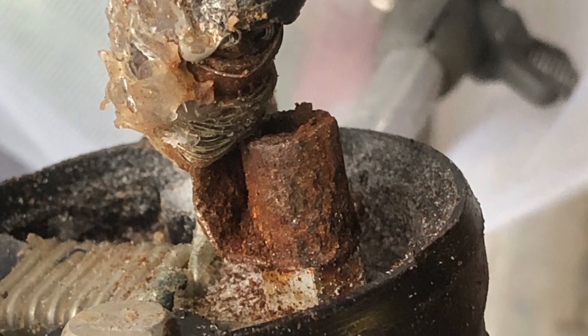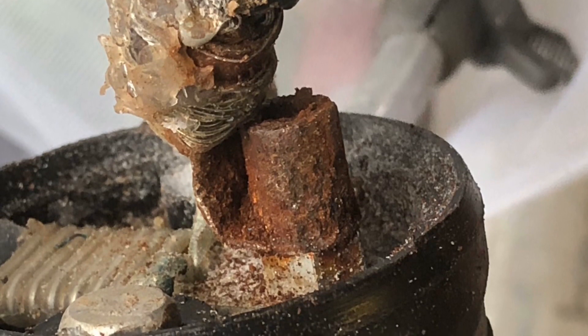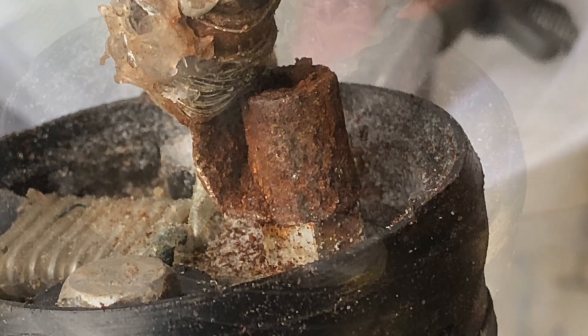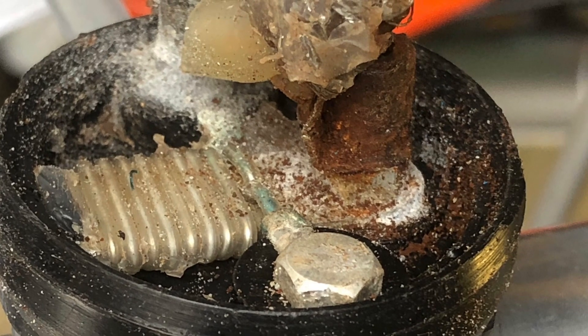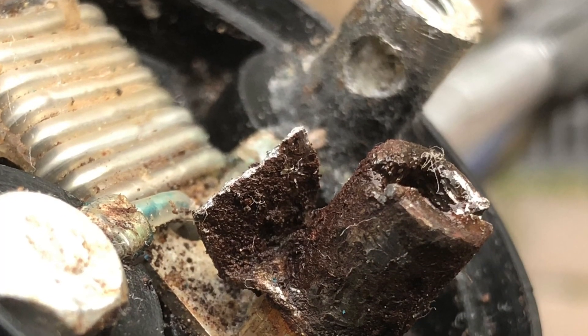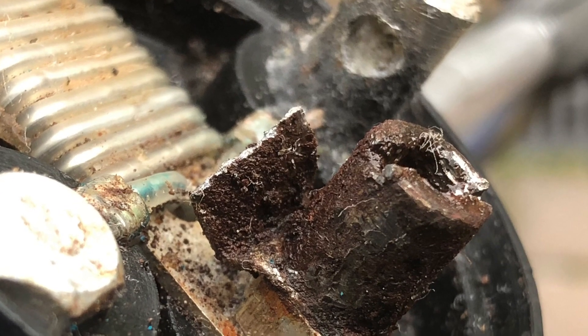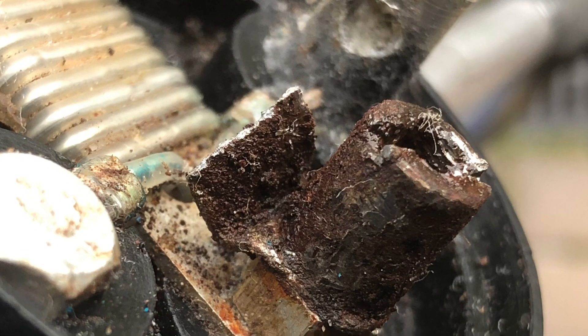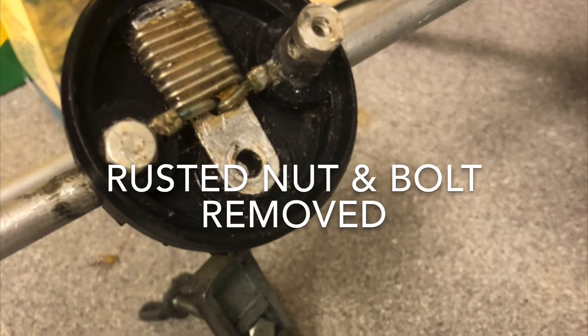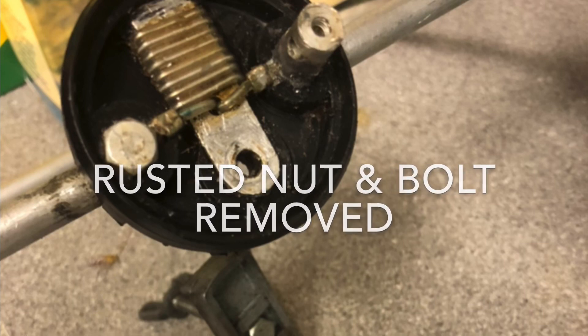The connection housing was rammed full of silicone sealant, presumably to waterproof it, but clearly it didn't do its job. You can see the coax connections are all rusted and the coax itself was corroded and rotten. With a tug of war and some pliers I managed to get all the silicone sealant out and make a decent job. The lesson here is if you buy antennas or other equipment, it's worth checking them out before connecting to your radio, as this could have been a disaster. The coax stub attached to it — the end socket wasn't connected properly either, so a lesson learnt and a tip if you're buying second hand.